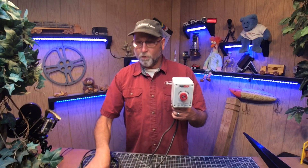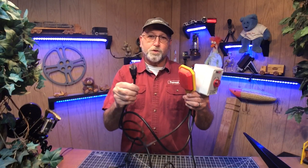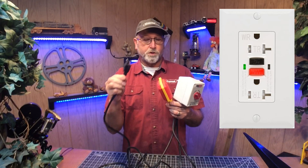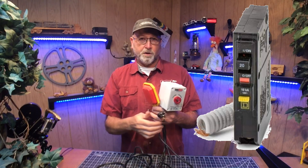So all I wanted to show you quickly is this is something that you really got to have. There's not a lot to this. Some of them out there you have to hardwire, but this one you do not. It's just 120 volts and you just need a receptacle — a GFCI receptacle is required, or the breaker providing power to the outlet needs to be GFCI.